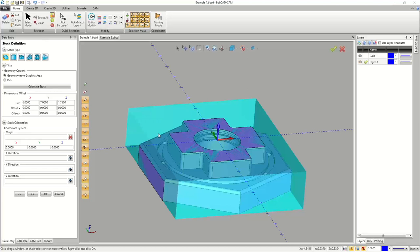I rely on myself at the machine to drop the Z down, call it zero, and then run a facing pass that creates my zero level. The reason I do it this way: if you set your origin 20 thou higher and then face off that 20 thou, every toolpath after that has to be programmed at negative 20. By calling the origin zero and defining the face at the machine, everything still starts at zero. You can absolutely add face material stock if you prefer — just remember every toolpath after facing needs that negative offset amount.